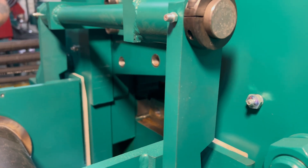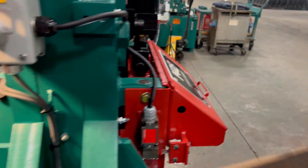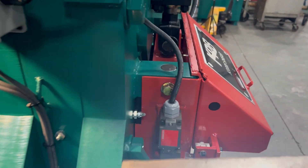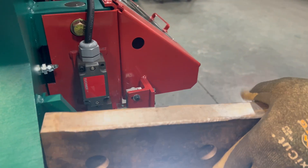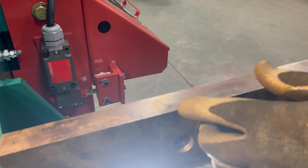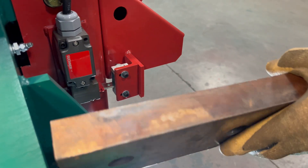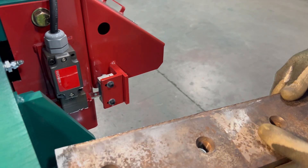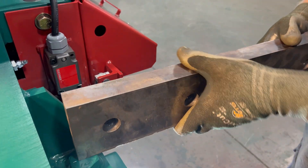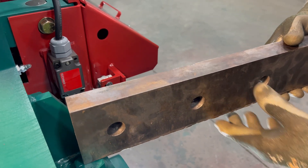Now when you pull the blades out, if you're going to re-flip them I'll show you. Let's say this was the old blade we took out — it'll be peened over a little bit. You just don't want to flip it right away to a fresh edge, because that peened-over edge will be against the shelf and the bolts won't tighten properly. So you want to take a grinder, grind that down flat so it sits back in the shelf nice, and you've got your nice fresh edge again to continue on.